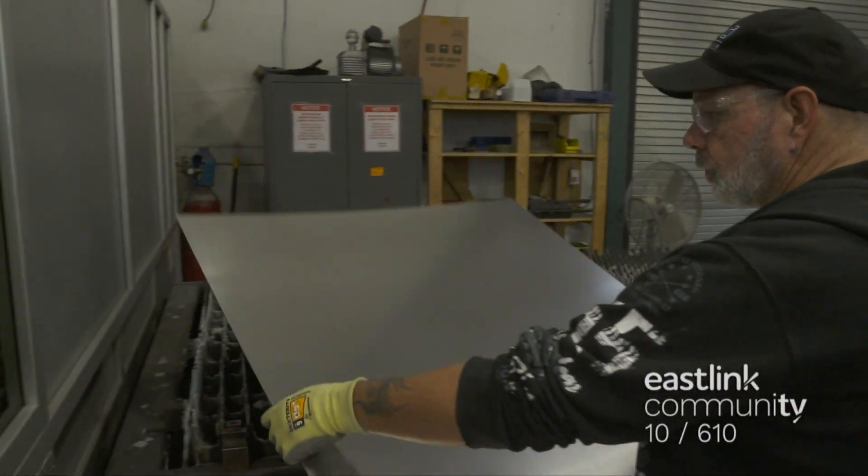In the paint prep department, the build sheets and parts are checked once again. Each part is hung on a rack and numbered for identification. The racks are then loaded onto a crane system and dipped in a variety of tanks for over an hour. Each tank contains either water or a soap solution that will thoroughly clean the parts and prepare them for painting. There is also a tank with a specialized chemical coating, which makes the enclosure corrosion-resistant, electrically stable, and durable.